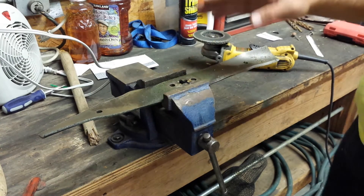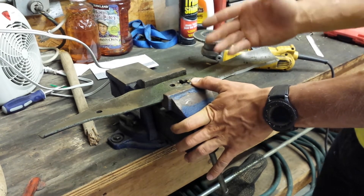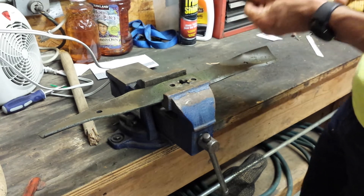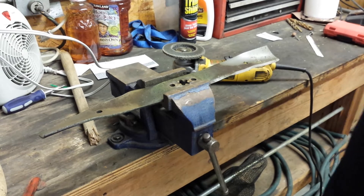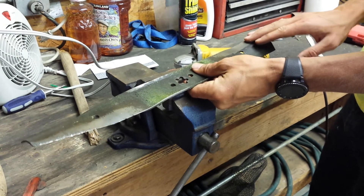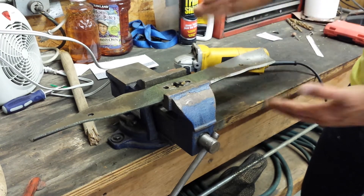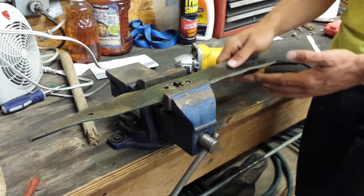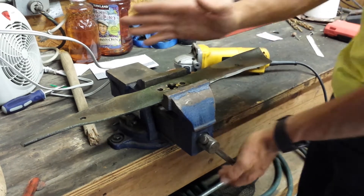You're going to put your mower blade in some kind of vise to hold it in place, because it will get hot when you're sharpening it. Once you've got it in there, grab your angle grinder with some kind of polishing or sharpening disc, and grab your safety glasses and hearing protection. One important thing — you do not sharpen the underside of the blade. These blades are supposed to be sharpened on one edge only. That gives them the downward cutting angle that's optimum for cutting the grass evenly. If you sharpen the underside, it's going to give you a weird cutting angle and mess everything up.